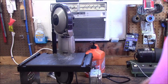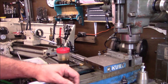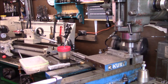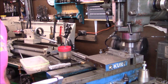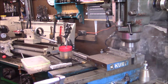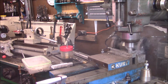What will happen is I'm going to make these into two six-inch pieces. Each piece is going to have its own slot in the same location. This is where we're going to put the cross piece in, which is going to be another piece of three-quarter key. We've got a three-quarter end mill — insert mill — in here, and we're just going to go across here, about an eighth of an inch deep.